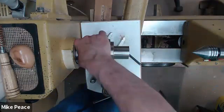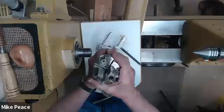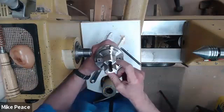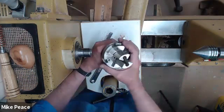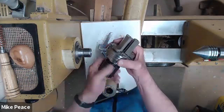And I think you can see that now when I take this thing off. Maybe. But that spindle adapter, after I ground off the end, just clears the jaw slides, just clears them. So that's the kind of thing you sometimes run into with spindle adapters.